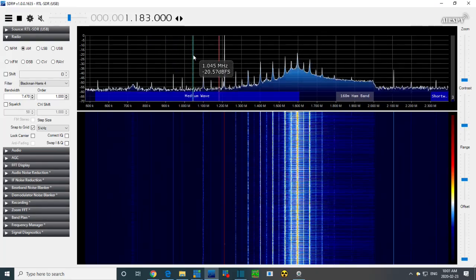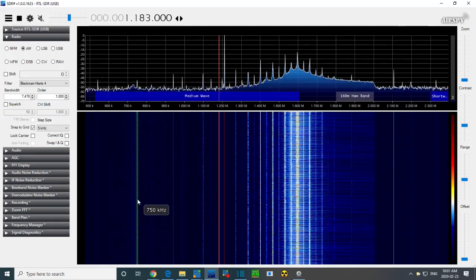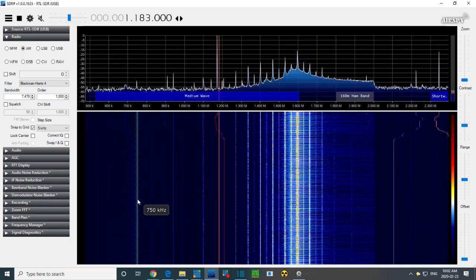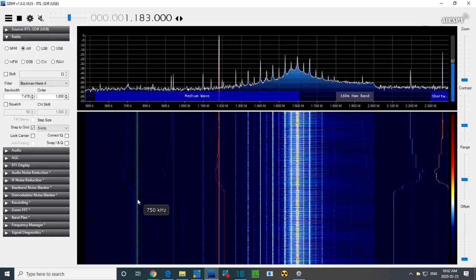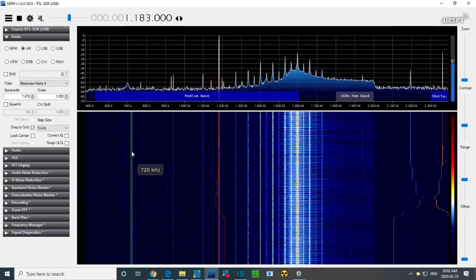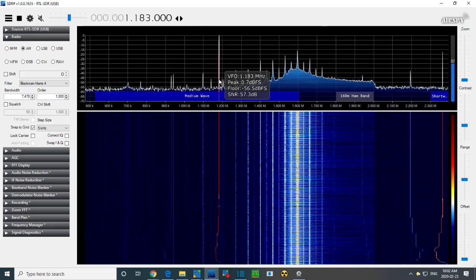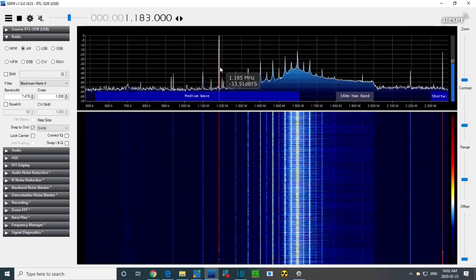So what we can do, I know there's no dial for me to tune against, but I'm going to put this response curve right on top of 700 here by tuning the radio, which I'm doing now. Get it right on top. So I know at least the front end of the radio is trying to listen to 700. Now, a local oscillator is trying to convert a signal at some frequency, hopefully 700, to 455. Let's see the frequency of this guy. 1185. Not quite.